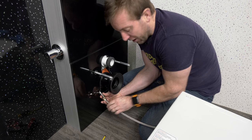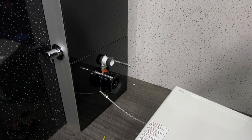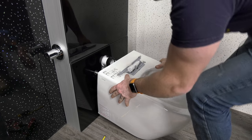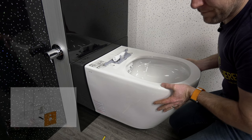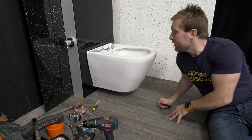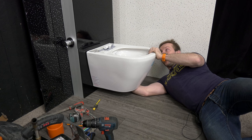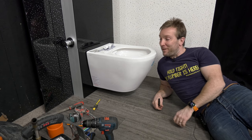Right, so we can do our final connection on here — just pull it over here, pull it with the hose. Now we can get the whole toilet installed. Just feed that back into there. So we're lifting up, pushing on and in firmly. Pretty much lined up on that. Also the Vitra comes with a shock absorber that can be cut to shape to fit between the glass and the toilet pan to protect the glass itself. Those cleats have now got that in place — the system is insanely good. The pieces we need to tighten are right down here at the bottom. All I had to do was that and now we've got a really well-fixed toilet.